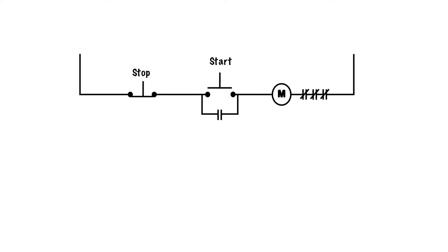Here we have a three-wire circuit. In this situation we have a stop button and a start button — stop being normally closed, start being normally open. We have an M coil. We again have our three overload contacts, and we have M contacts here which are associated with this M coil; when this energizes, these close. So we'll push down on the start, the M coil will energize, and M contacts will close — power can go all the way through and M is energized.